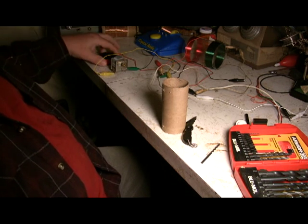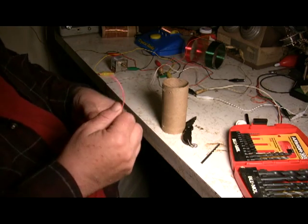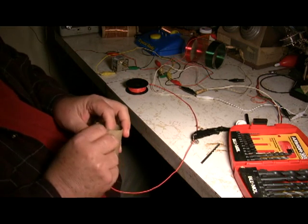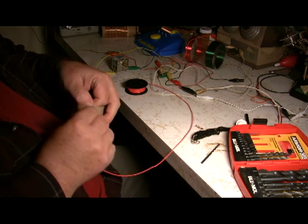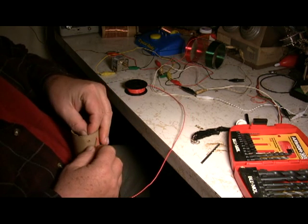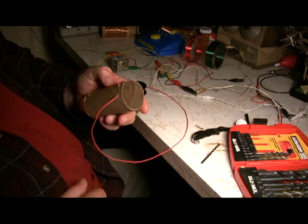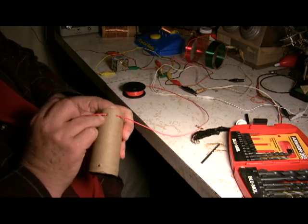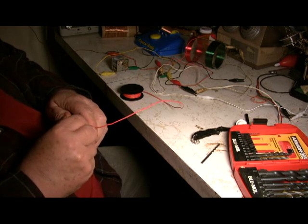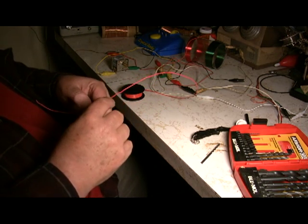Right now I'm just going to use some of this hookup wire here. Run some out — you want to have some kind of a lead coming off of it. I'm going to run it through here and out the hole. You can double-loop it — if you make those holes big enough you can actually run it through again and have it come out twice so it's wrapped once. Okay, now we're going to start wrapping this wire.